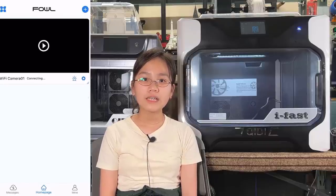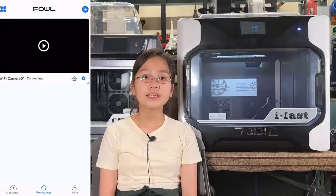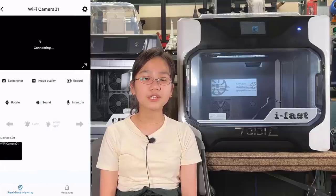The software engineers at QDI should do more on this part and at least integrate it with the QDI slicer, or make a mobile app for the camera with some basic controls of the printer like printing G-code files on the USB as well as monitoring the current print job. Another issue with this camera is when the chamber temperature reaches 50 degrees Celsius or higher it may stop working after a while. It would be better to equip a camera that can resist up to whatever the heating chamber can reach — which in this case is 80 degrees Celsius.